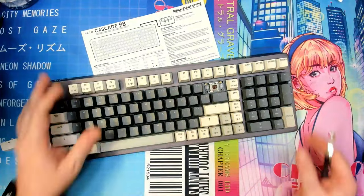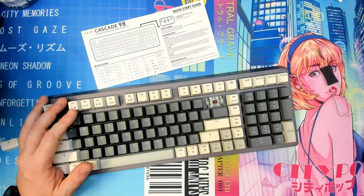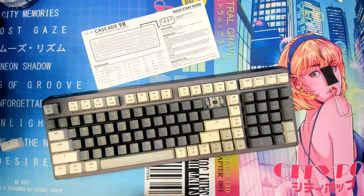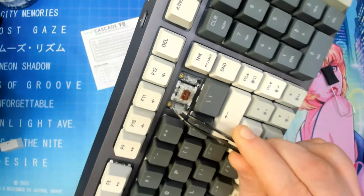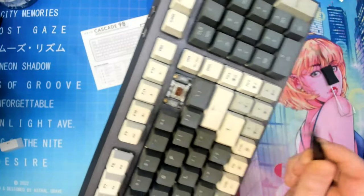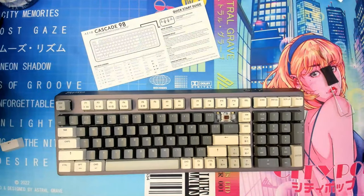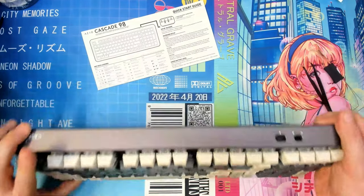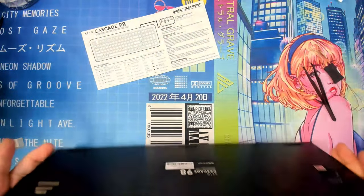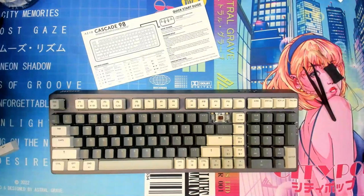All right. Now, this is one thing that they had with the Cascade 75, that they also have with the 98, that you still do not see that often, though we're starting to see it more and more: PCB screw-in stabilizers. Look at that. I think that's awesome. I can't tell you how nice it is to see off-the-shelf keyboards that have screw-in stabilizers. Now, this is an aluminum top plate or top case with an integrated plate. The bottom is plastic, but this top is aluminum, so we're basically dealing with an aluminum plate. So if you like the sound of aluminum plates...